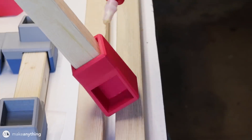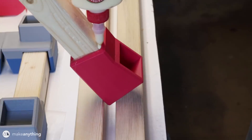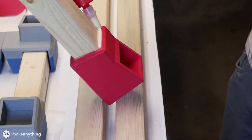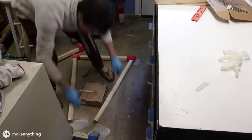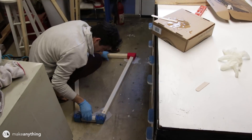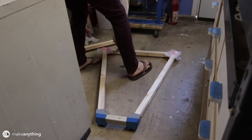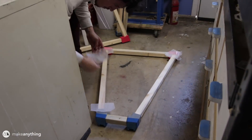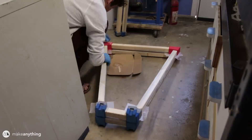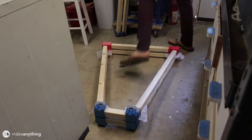Here's one of the parts that cured. I'm going to fill in the empty space by squeezing in some wood glue, which is a lot cheaper than epoxy, and I also put a bit of sawdust in there which helps make it more dense. Here I'm finalizing one side of the rig using more epoxy, and once that's all cured I'll flip this around and stack my second piece on top to use the first one as a reference, making sure both sides are exactly the same. Since it is so wobbly, I want to make sure to mirror it as well as I can.